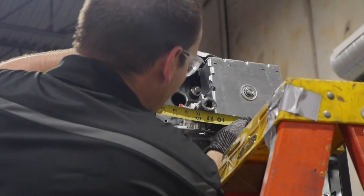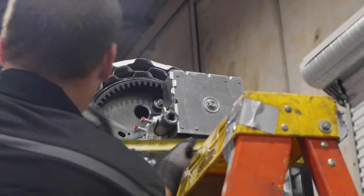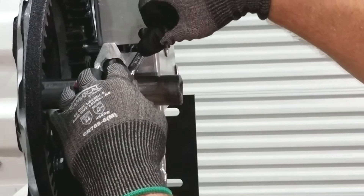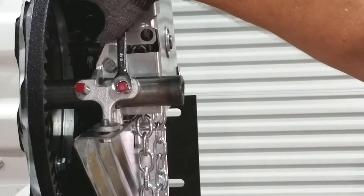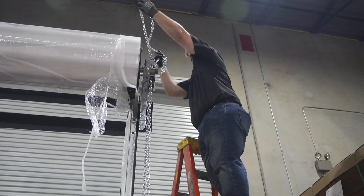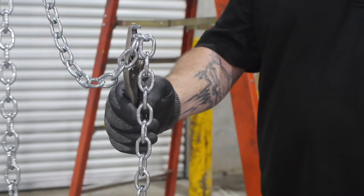For the reduced hand drive end, attach the cast axle support bracket to the door bracket using one hex bolt, one lock washer, and one flat washer. The chain hoist can be universal, meaning it can go on either side of the door. The spur gear on the hoist will engage with the external teeth of the cast ring gear on the end of the drum. Connect the cast axle support bracket to the side of the chain hoist using a hex bolt and lock washer. Feed the hand chain over the chain pocket wheel and through the hoist. Connect the ends of the hand chain, being careful not to twist the chain. The hand chain may be lengthened or shortened as necessary.